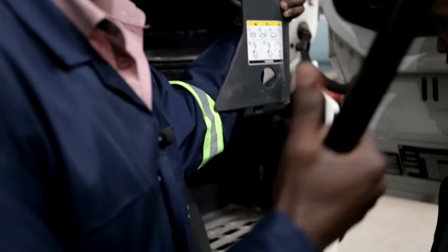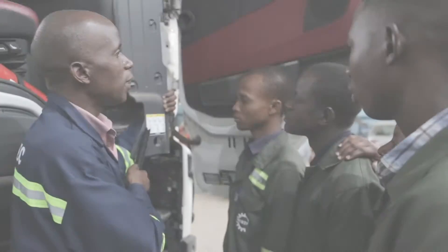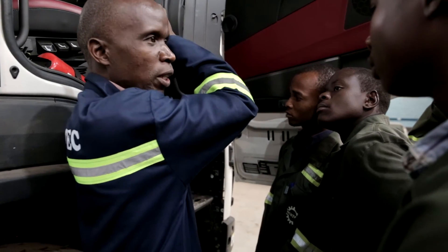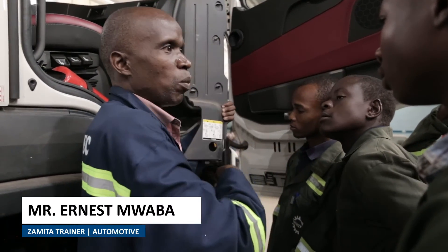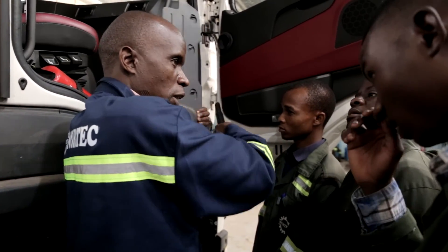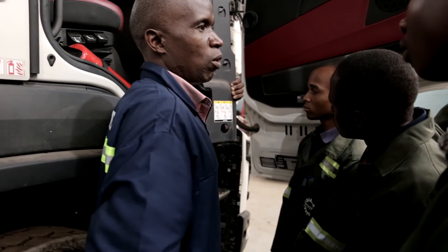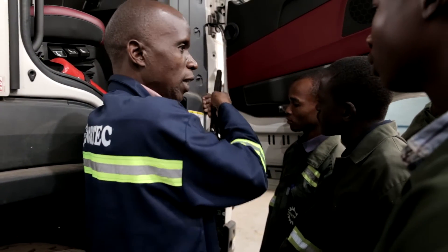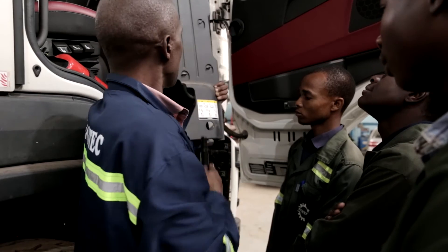Some trucks will have a pump which you can just operate. Before we do that, please come and check here. I sent him to go and check if we have any objects that can fall on the screen, and that front part — the cover — should be open. If it's not open, you will damage the truck because it needs enough movement to tilt. The cover can easily pinch into the front of your vehicle and damage it. So to avoid that, it must be opened like we opened it. When you've done that, check inside. Everything should be safe so that when we tilt it, nothing falls and causes damage.